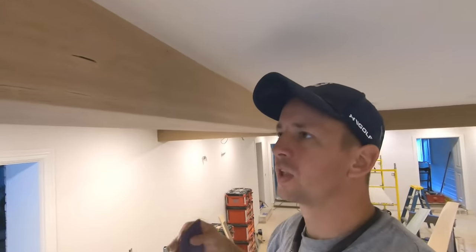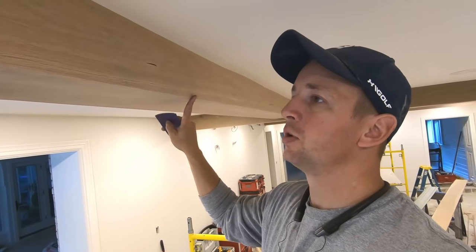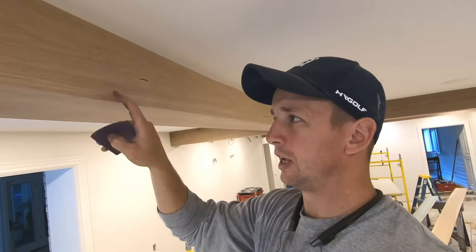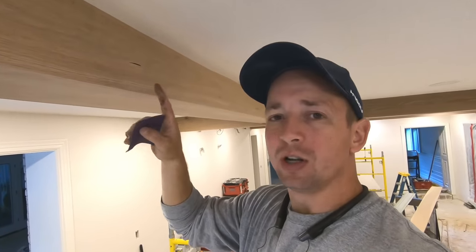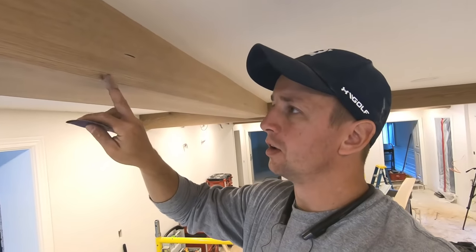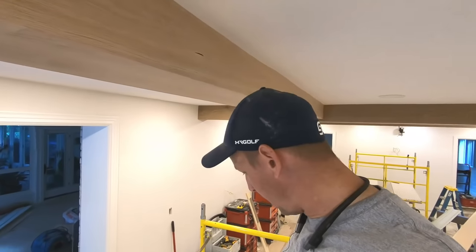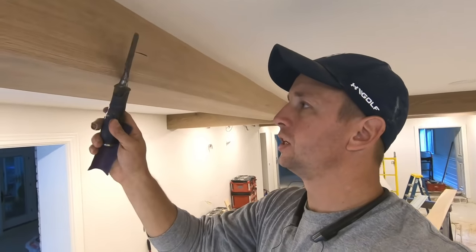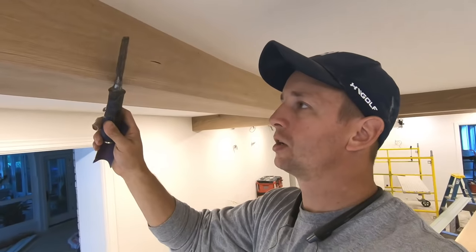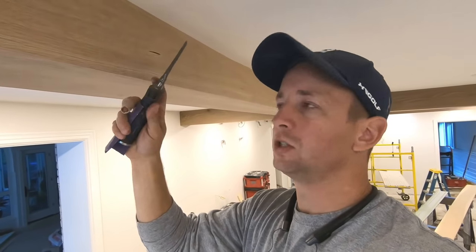So a couple tips, whenever you're trying to do a corner like this, again, it's important to cut 46 degrees, that way you know the outside is gonna come together pretty well. You want a little bit of glue squeeze out, that'll actually help in sealing up that corner after we get to the last step. So after assembly, you burnish it, kind of round over that edge, compressing it with something round. Here I just used the shaft of my chisel.